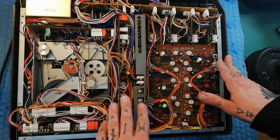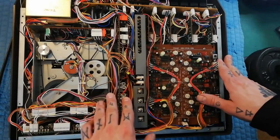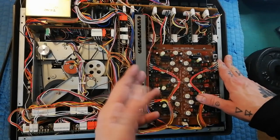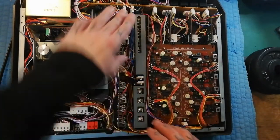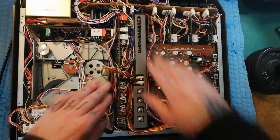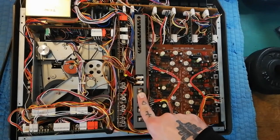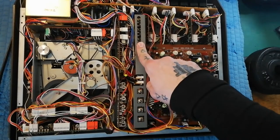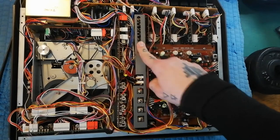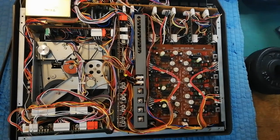The last place where there are moving parts and crevices where a lot of dust can accumulate is the recording and playback amplifiers — these ones here. This board here is for playback and this one here is for recording. In here we have the auxiliary master control, the bus master control which also controls the headphone out, and the master fader is buried in there as well.